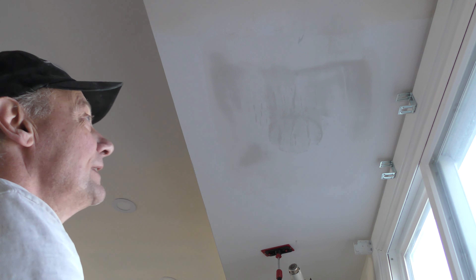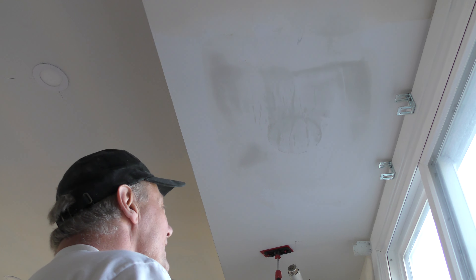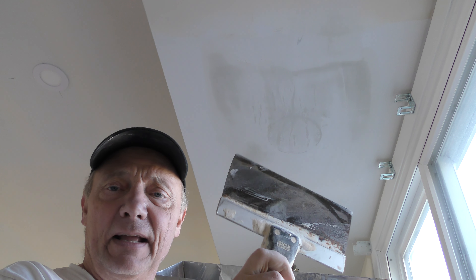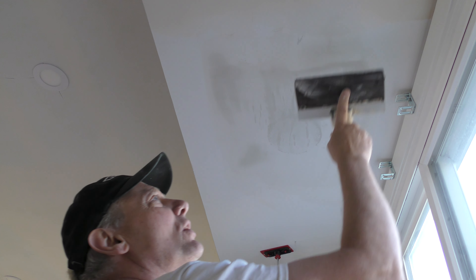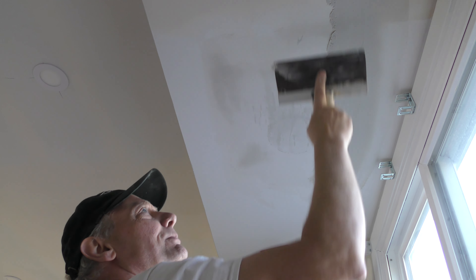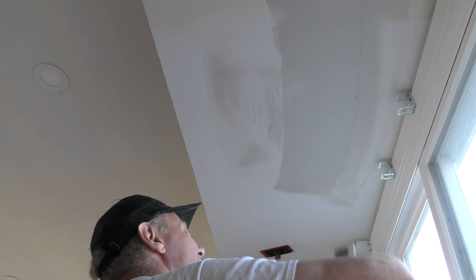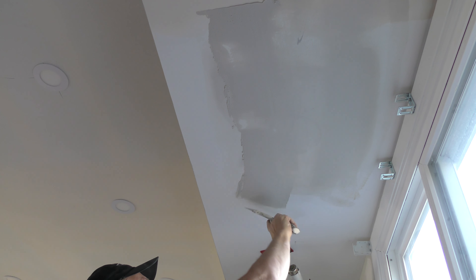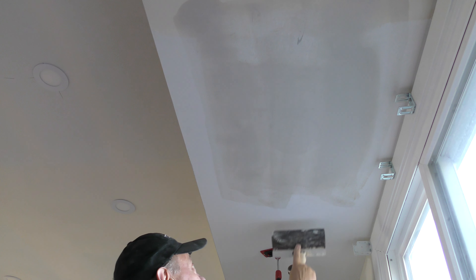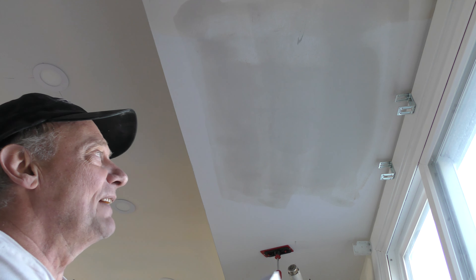Here I'm putting the final coat on. You can see the outline of the patch. Some people say you have to use these great big wide knives — listen, I did this entire patch with an eight-inch knife. Now I'm going to put my final coat on, pull it very very tight, and go out just a little bit more than I did the first or second time. I'll let this set up a bit more, then I'll show you how I sand it. Some people might just do this coat and then take a spray bottle, spray it, and wipe off the edges — that will work, but I'm going to do it nice and tight.